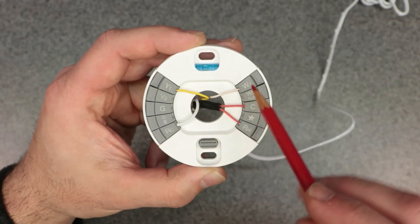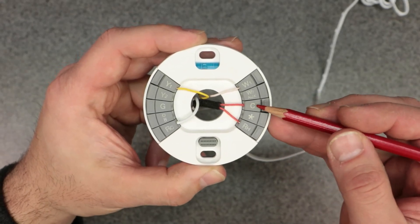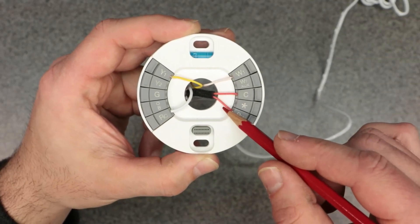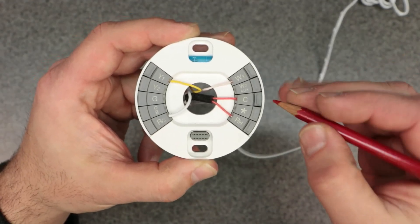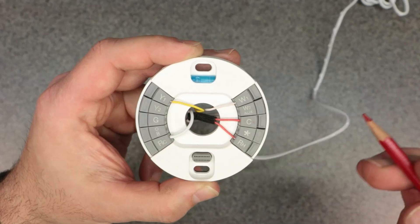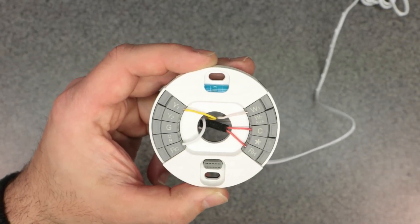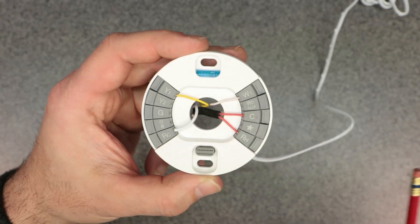It has to have all the wires you tell it connected — that's why you see the Y and W wires hooked up here, but we're focusing on the power wires. To power this up, you hook up to C and RC. As I have it here, I have it hooked up to C, RC, and RH. These two wires are essentially the same wire. If you keep it to two wires, you go right to C and RC and it will power up the thermostat. Google Nests are very picky — you have to have all wires connected for it to even proceed to the menu.